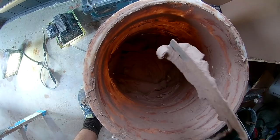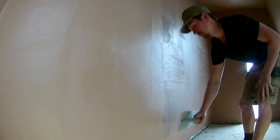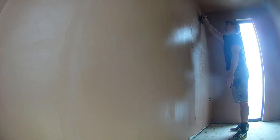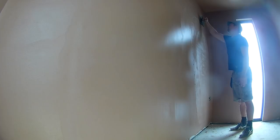This is an hour 20 — it's very stiff now, but still, push comes to shove, I could definitely apply that to a wall or a ceiling. So an hour and 20 minutes, that's the first mix — it's definitely doing a good job. You definitely wouldn't get that without the Extra Time. I'd say that's given us an extra 45 minutes, and I probably put a small amount in compared to their recommendations. And as you can see at about an hour and 30 minutes in, I don't need to use any water — I'm flattening it, no water needed. It's literally troweling up nicely with not one bit of pressure needed. I can still see it's nice and wet, easy to work with.